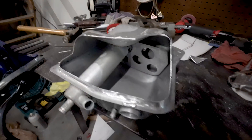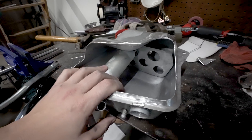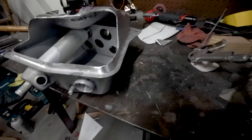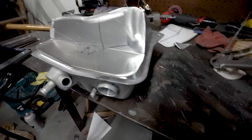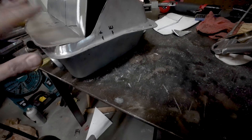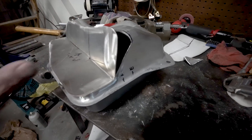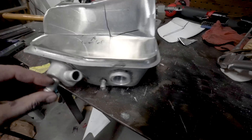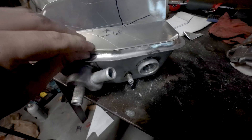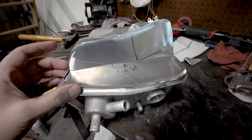Try two. We have opened this guy way up this time. We're going to put this much lower and the main tube is actually going to go through here, with a little chunk of aluminum going in there. I'm going to get this partially welded in place and then hammer this bend over right here to cover it up. So this guy's going to go in here and seal this up, and we'll get back on the airplane and see if try two fits.